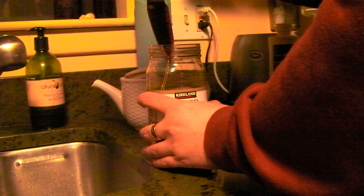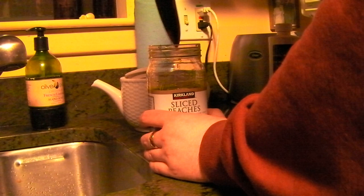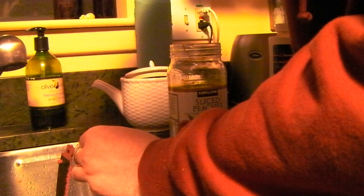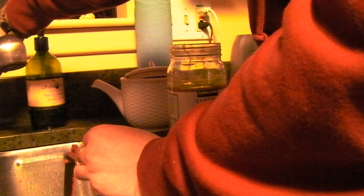I should also point out that I am using a steel wire to suspend these. It is coated though, which protects it enough that it's not going to get eaten straight through. Stuff isn't that acidic anyway. It's not like movie acid. Which is, by the way, before anybody asks, why I'm not wearing rubber gloves. You know, it'll eat a few thousandth of steel if you leave it in there for an hour. But if you get a drop on your hands, you can't even feel it. You just wash it off with water.